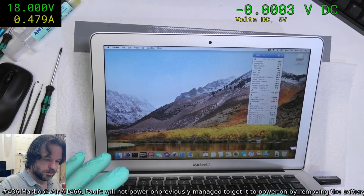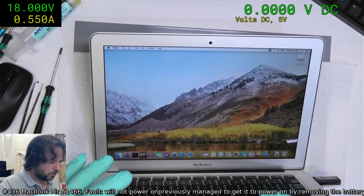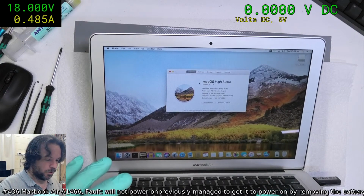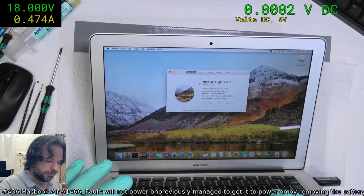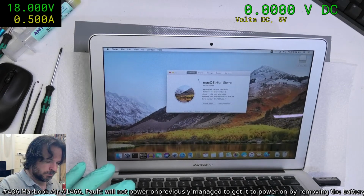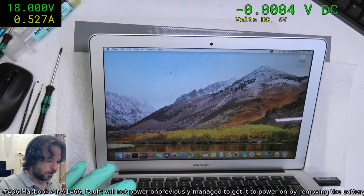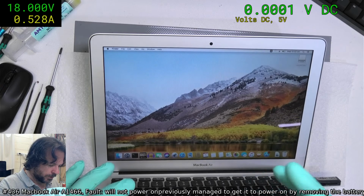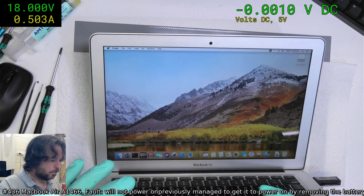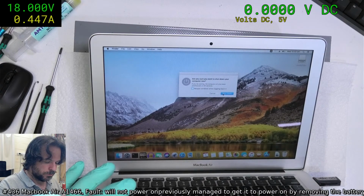Okay, temperatures are good. Wi-Fi only shows A, which is good, because that's all that should, because there's no antenna connected. Which means it is only going to pick up that one router that's about 1.5 meters away from me. So we've got 1.6 Intel i5, 4 gigs. Okay, so that's fine. Sort of a mid-range, early 2015. Interesting that they're only putting 4 gigs into them even in 2015. Alright, well, we'll put that through proper testing after I've done the ultrasonic clean on it. Shut down.